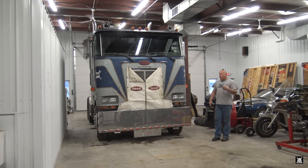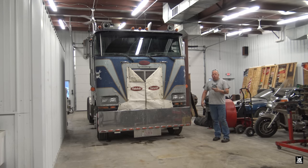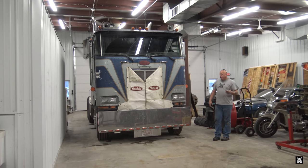Anyway, I tried putting some alcohol in the feed line from the compressor to the dryer. That didn't do anything. I'm like, okay, that's not helping. I'm thinking this is more of a governor problem. It's building up some, but not enough air pressure. So my answer to that point was, let me try to send some alcohol up that small line uphill, up into the governor itself, which I did. That solved the problem, but it was still hissing a little bit.